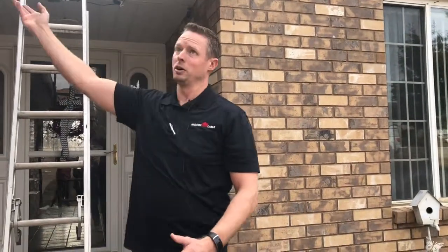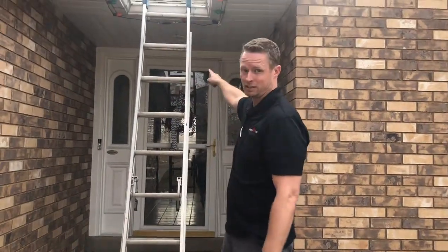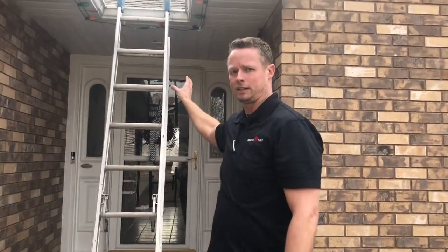We don't have any power up in our soffit. We do have a soffit light, but that soffit light, I would highly recommend avoiding it, because often the wiring controlling or powering a light is not going to be large enough to accommodate the power consumption of heat cable. So stay away from sconce lights, any light fixtures. Don't use those adapters for that.